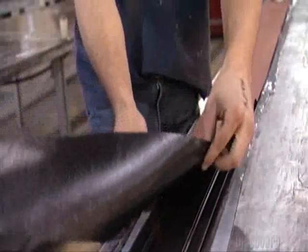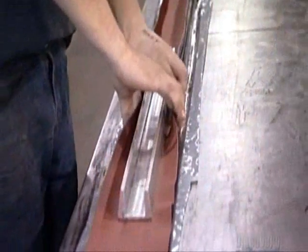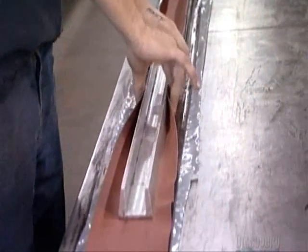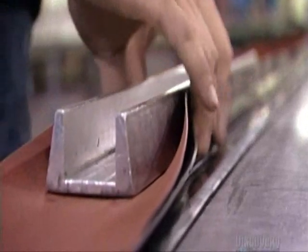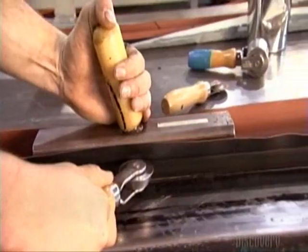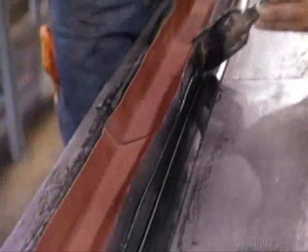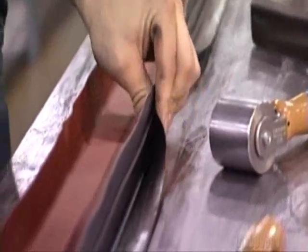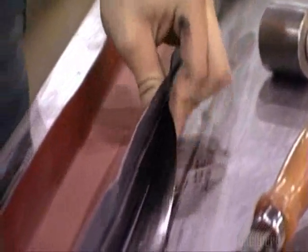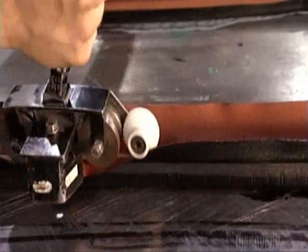Next, a worker places a piece of rubberized fabric and one of synthetic rubber on either side of the four-plied strip. He presses everything except the strip of rubber around a U-shaped aluminum former. With a piece of steel, he bears down on the shape so the layers stick together. Then he brushes tack cement on the outside and pulls that piece of synthetic rubber at the bottom up around it. He folds the rim down, and using a hand roller, he seals its edges.